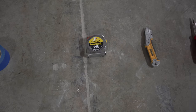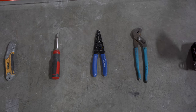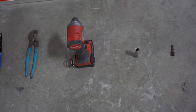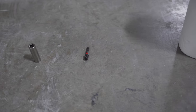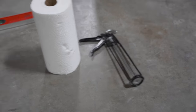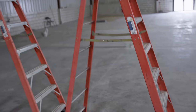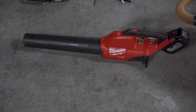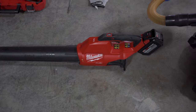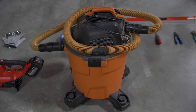You'll also need painter's tape, a 25-foot measuring tape, a utility knife, a screwdriver, wire strippers, channel lock pliers, a cordless impact driver, a 9/16ths socket, a socket adapter for your impact driver, paper towels, a caulk gun, a 72-inch level to make sure everything is plumb, and two 8-foot ladders. Optional items include a cordless blower or a shop vacuum to clear anchor holes.